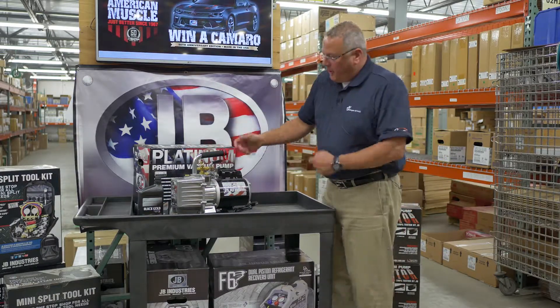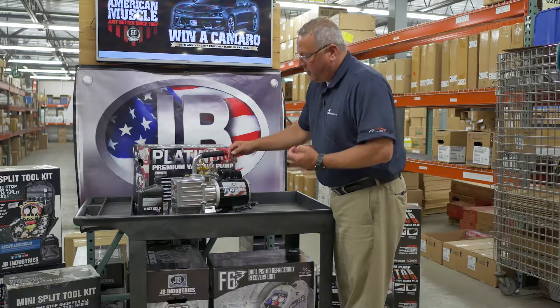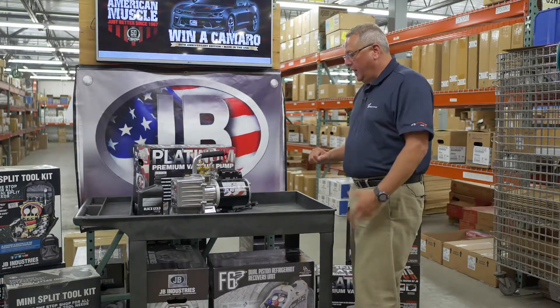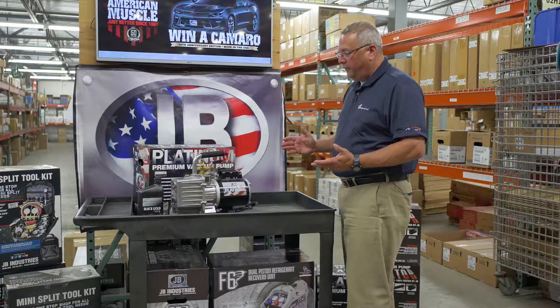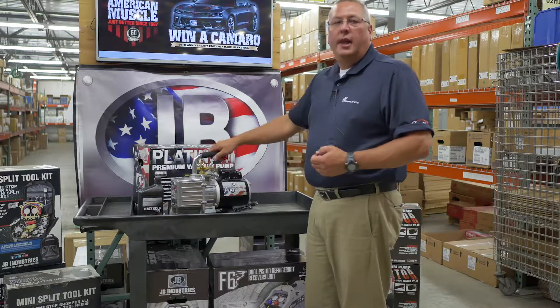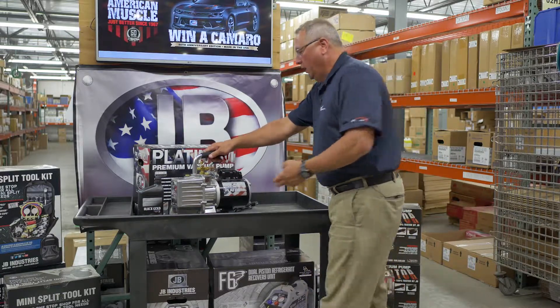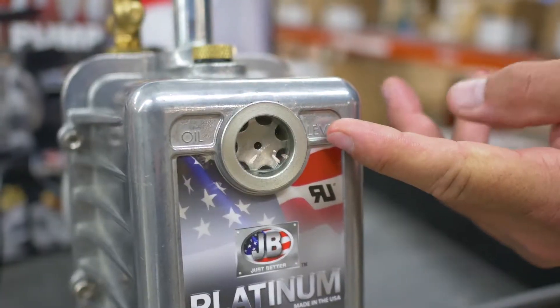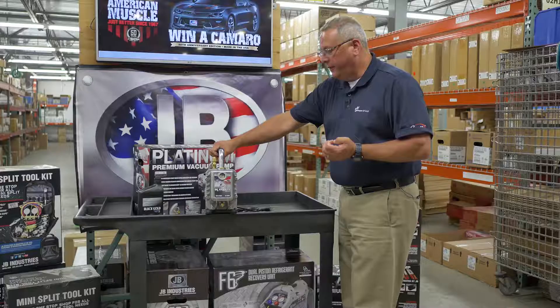What you see is our pump here — we've got a nice beefy motor, but a couple of neat things differentiate us from the rest of the field. We have our gas ballast up front here, which is going to improve the oil life of our pump, along with a rather large oil reservoir in the front with a sight glass to see where we are in terms of oil fill.